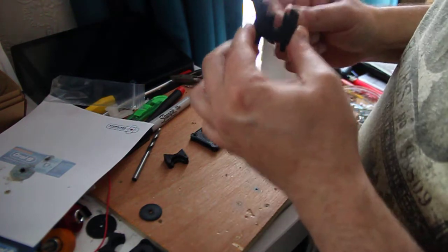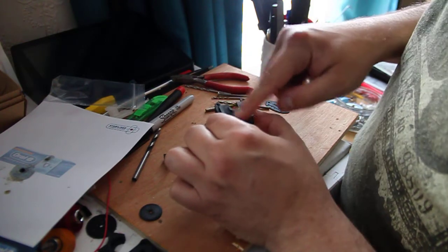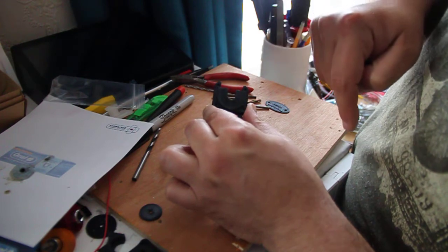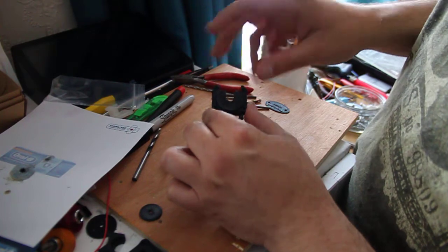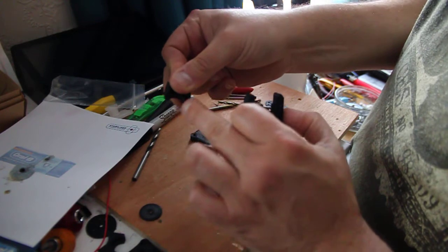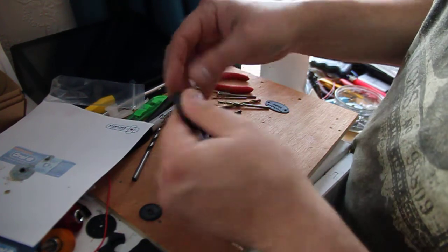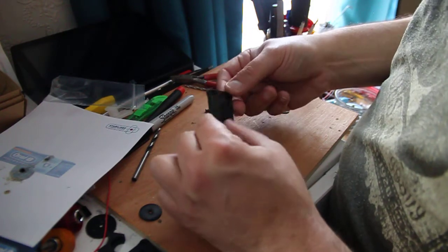You can use a small file if you want to. Just make sure, again like the groove mount, that this top surface is nice and clean. Then we're going to drill through each of these four corner holes with a 2.8mm drill bit to make sure they're the right size for the M3 screws to tap when the module's assembled. File off any elephant's foot or roughness along these fitting surfaces so that the clamp will fit smoothly into the module.